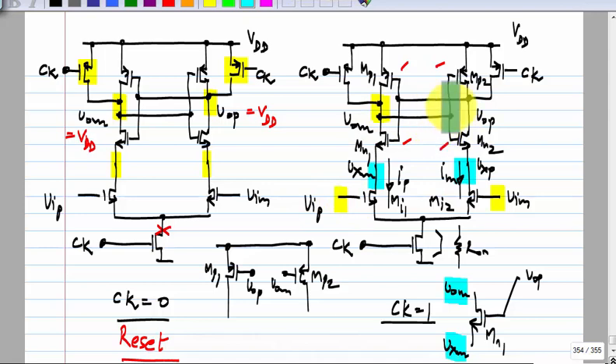That is what you wanted — in the model for the flip-flop I had a sample-and-hold: you sample it, the input has full influence, and then you remove it so it has no influence. In this case it is not as abrupt, but you can see the same thing happening. Initially the input pair draws currents and has influence on the output nodes. After a while, regeneration takes over and the input differential pair is getting crushed and has no influence on the output node — that is like the holding part.